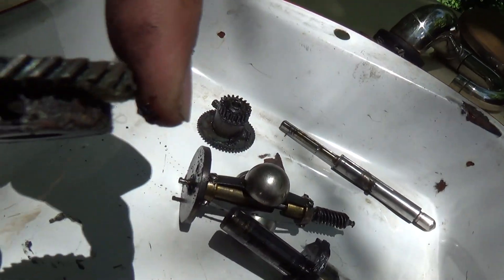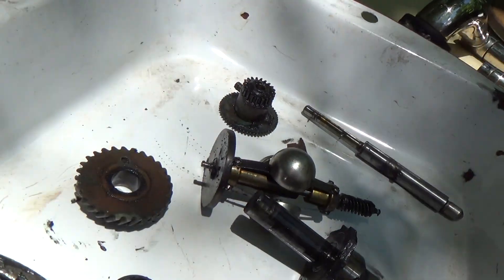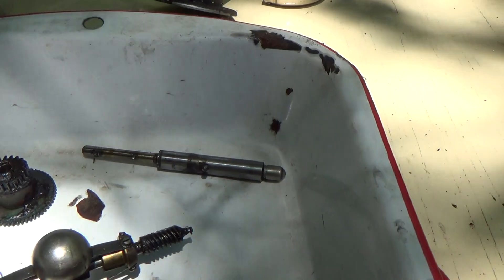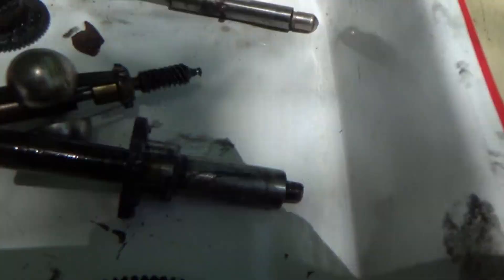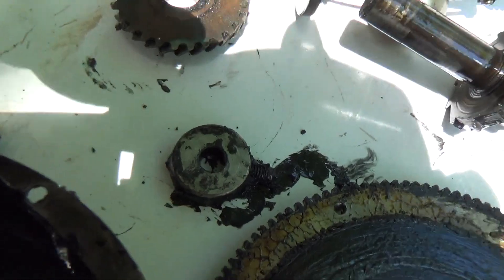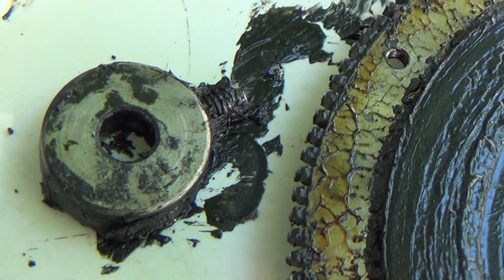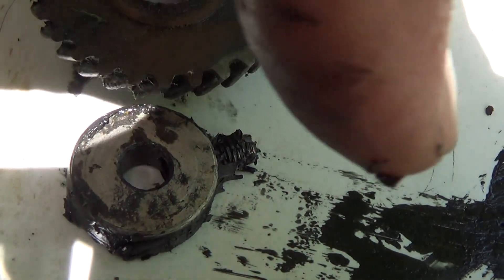Here's another one — set screw. This would just go right out of the machine if the screw got loose, and this one was also loose. Every set screw in this was loose. This little collar right here — there's a bit of bright sunshine today, but see that collar? That's the set screw, right there. It was loose.